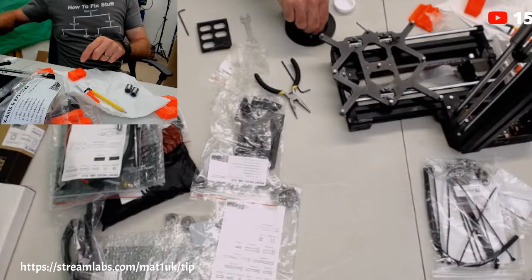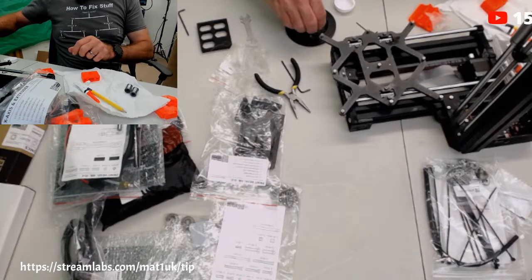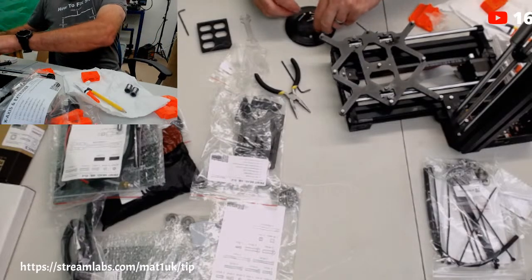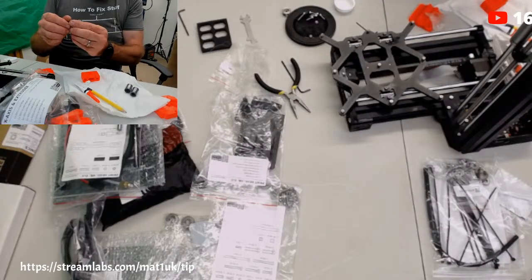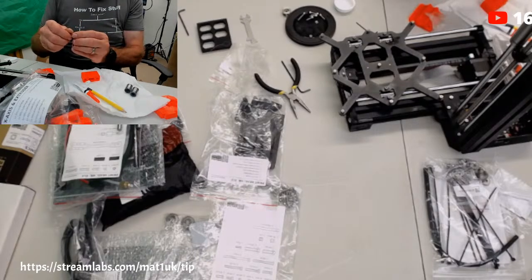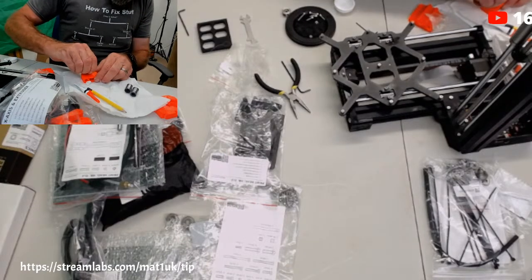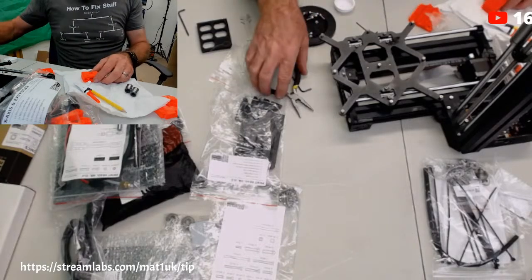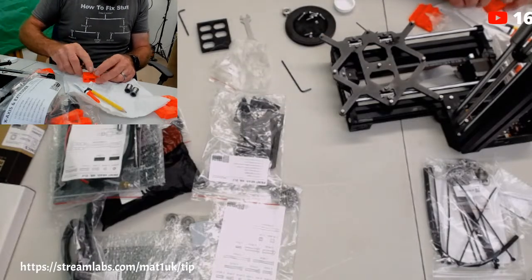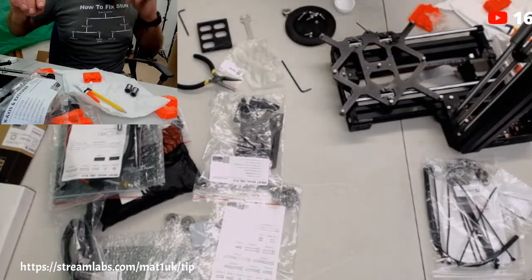So we then got to put the lock nut into there. So the age-old way, put the nut onto a bolt, like so. Press it in like that. Give it a little wiggle. You get it started. Flat side of the pliers. In she pops. Where she stops, nobody knows.